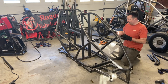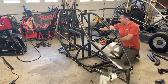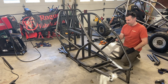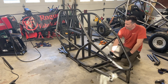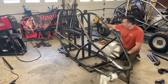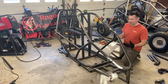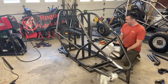Something else you can do is use the crossmembers to align everything. The rear crossmember goes just above where this pipe or bend starts to go straight towards the roof, and this one sits at the center of the bend. You put both those in place, measure the angle from the ground — since we're working from a jig — and when that angle matches, it's in the right place. If those four points line up and the angle is straight, then you've put these pieces in the right place. I designed the chassis that way to make assembly easier. If the right is squared to the left and the crossmember lines up, then the whole frame stays square, and the order of building reflects using those crossmembers to help align things.